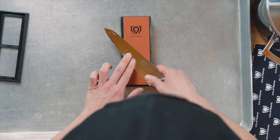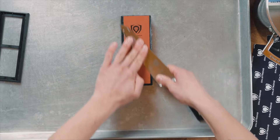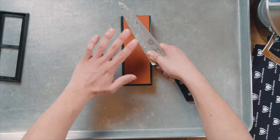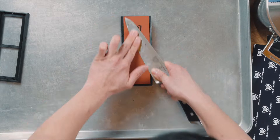What you're doing is basically grinding the edge on the stone, going back and forth. I'm using two fingers and just putting pressure down. What you're looking for — what I've been taught — is that you want to feel your two fingers feel the blade and the stone grinding against each other.